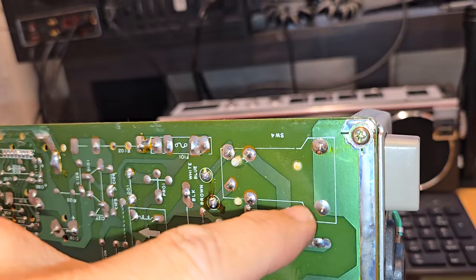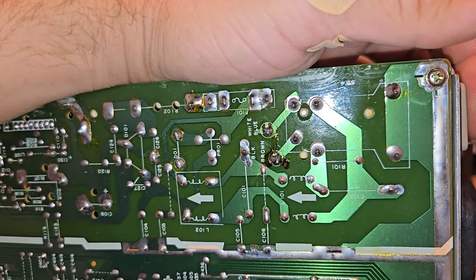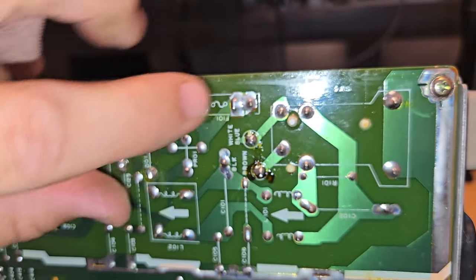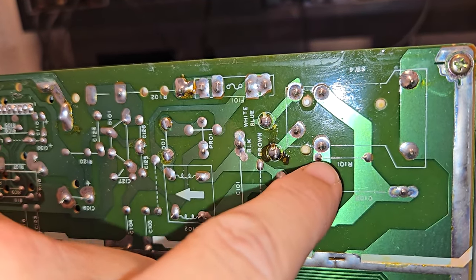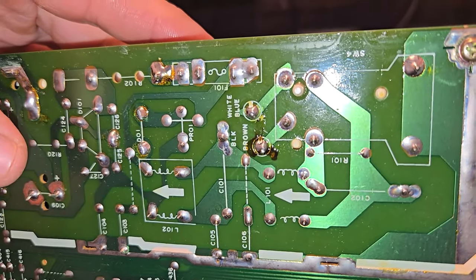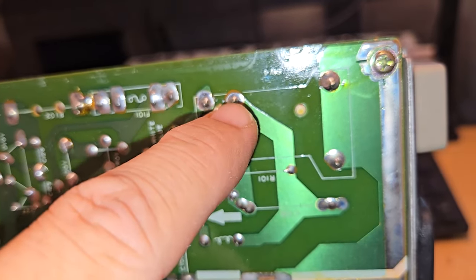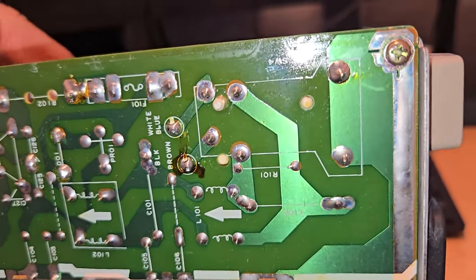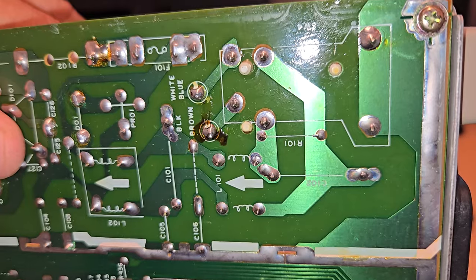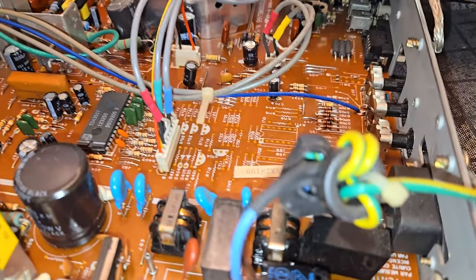Okay, so this is the bottom of the switch on the circuit board, and it's broken. What this switch essentially does is, when you push it down, it's supposed to click closed, and then it will bridge this point to this point, and this point right here to this point. So it just closes that gap on both sides, and then it allows electricity to flow through. So essentially, if we just install a bridge jumper across these two points, it'll pretty much always be turned on, no matter what this button does. So the button can at least stay there, but it won't actually function. That's probably going to be our best solution, since the button itself has mechanically failed internally.